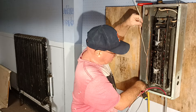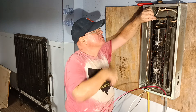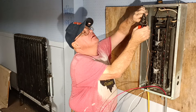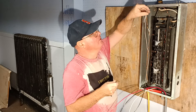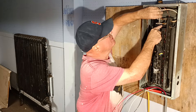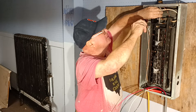We'll do the same with our white wire — push it down to our corner, bring it over, and bring it down to a screw down here. This is a main panel box. So we will strip some of our number 12 insulation off, put our wire through the terminal here, and make sure our copper comes down through the terminal.